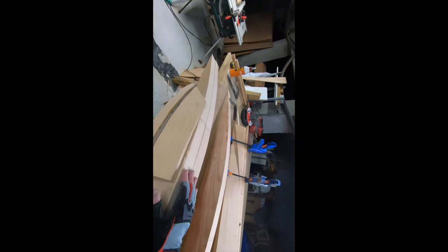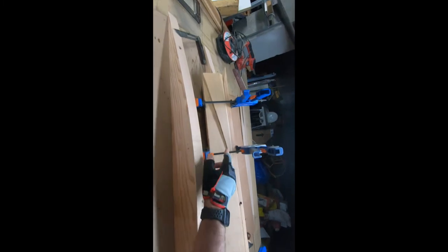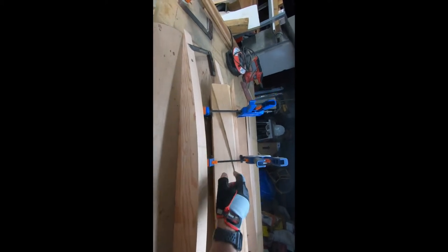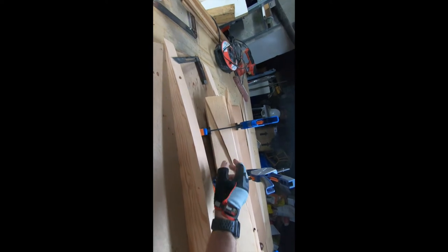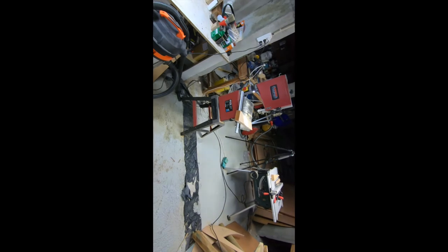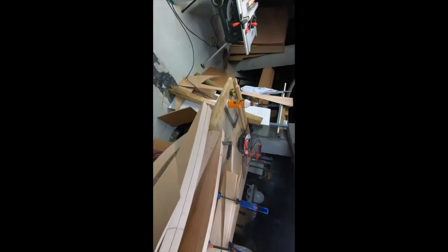What I have to do is put this upside down on the flat plate, but I can't keep it level because it's on a curve. So I got some of the off-cut wood, cut another piece on the circular saw, and glued it on top. That gives me a flat bottom so I can turn it upside down and then follow the bandsaw around those two corners, flush with that. I'll give that a go after lunch — let the gorilla glue dry for a couple of hours. I'm really pleased with these curves.